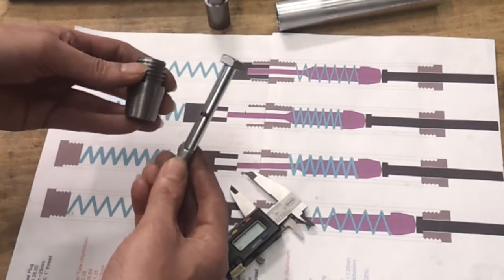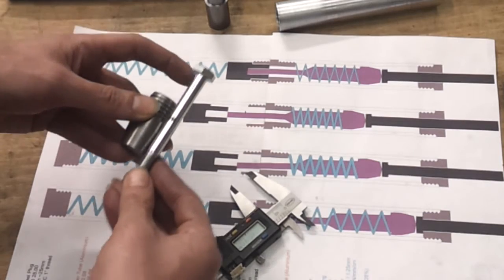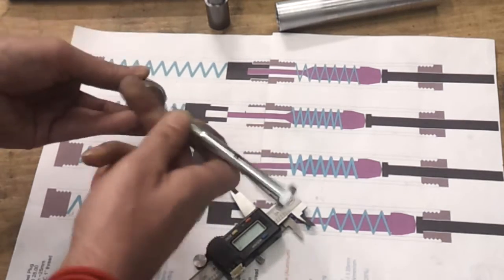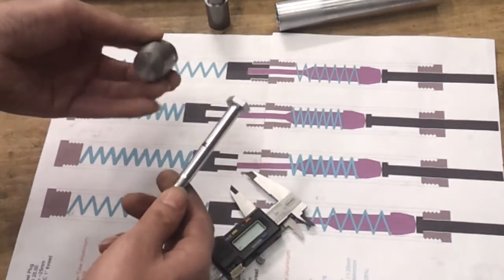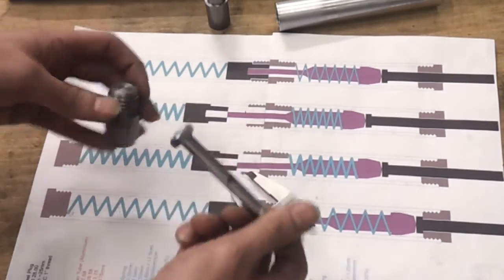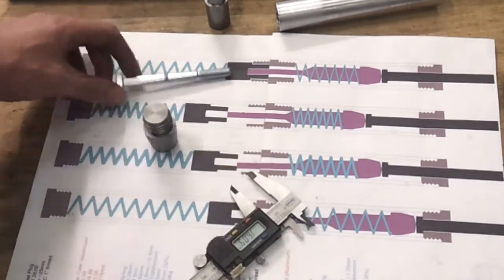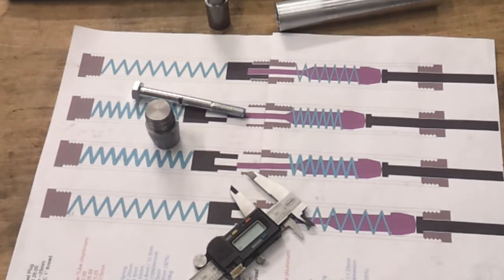Next stage I'll work on this, and for my punch pin at the end I'm just going to use a 10mm bolt to begin with, because that's got a good 40mm of travel on it. I may need to turn this down a little bit and shorten it, but basically just drill a hole through there, drop it in, and that'll do for a start. I'll probably end up making a proper one in due course but for a test let's keep it simple.